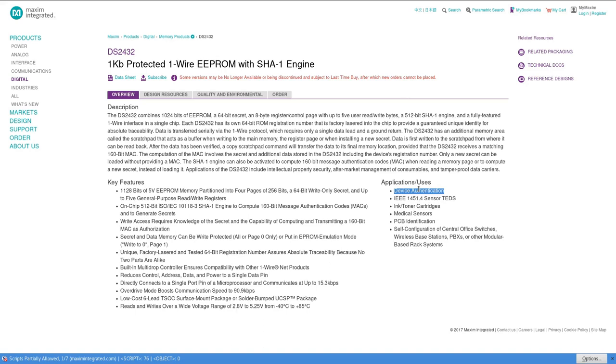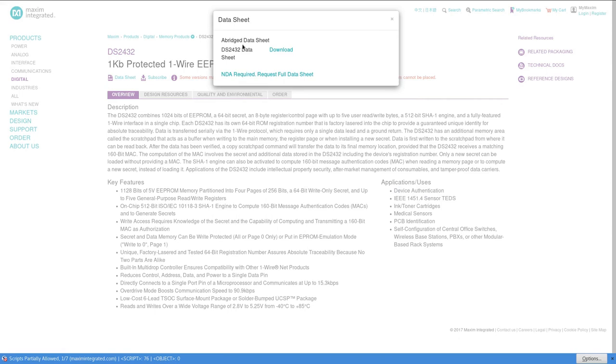And last, but probably the most important point, well, toner is pretty expensive, and printer manufacturers don't make a lot of money out of printers. I'm even surprised they can make any profit out of it. What they make money off, and a lot, is the toner and the ink. This is the main revenue. So you don't want any counterfeit toner or ink cartridges. And to avoid having counterfeit ones, you can use an authentication method. This way, they authenticate the chip which is on the toner to be sure that this toner which is plugged in has been provided by them. We still want to have a look at the data sheet because we want to compare if the function commands correspond to our trace, or to what we have.